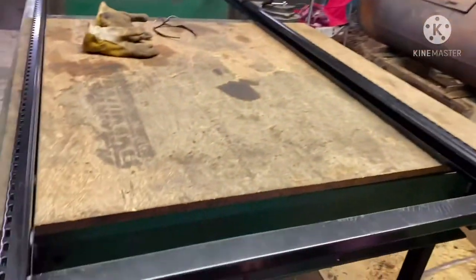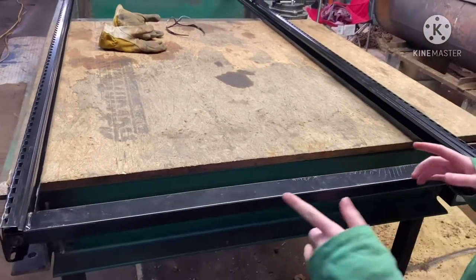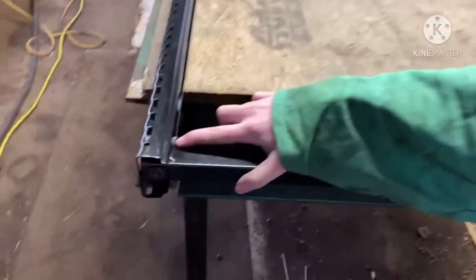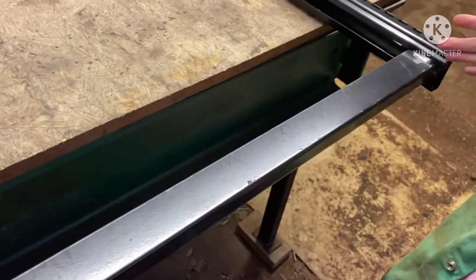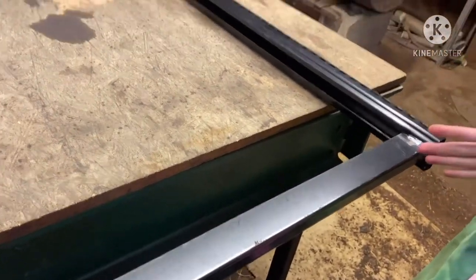So now we're on to making the main frame for our gate, which is going to be made out of this. So this bar is welded in at both ends. On this end, we're going to cut the bar completely out and make a different bottom for it, so it's flush with the ground, because since we're going to be running sheep through it, you don't want them tripping over themselves, because that could cause problems, and I don't want to have to go in through a herd of sheep and fish them all out.